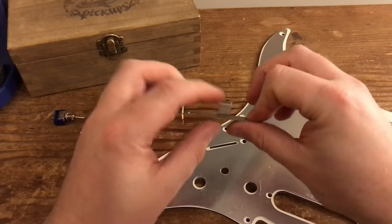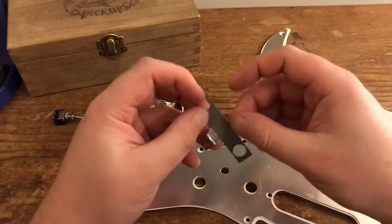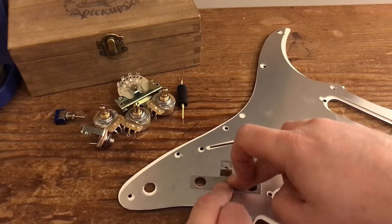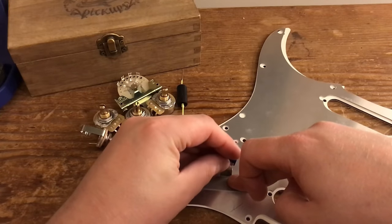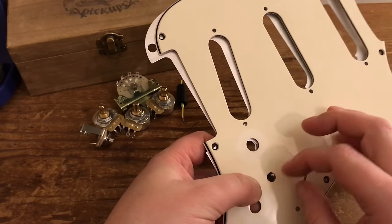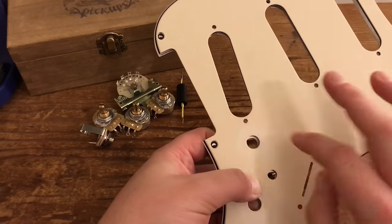This is especially made — if you go onto eBay and type in 'Gilmore brackets' this comes up. It costs £3.99 and it's made by a guitar parts company in the UK, North West Guitars. It's a little ingenious idea — it literally sits across the two pots, so when you fasten your pots down this bracket is where you put the switch. The whole point of the bracket is that the switch is elevated, so when it comes through the other side you only get the top of the switch poking through — it's hidden on the lower echelons of the controls.